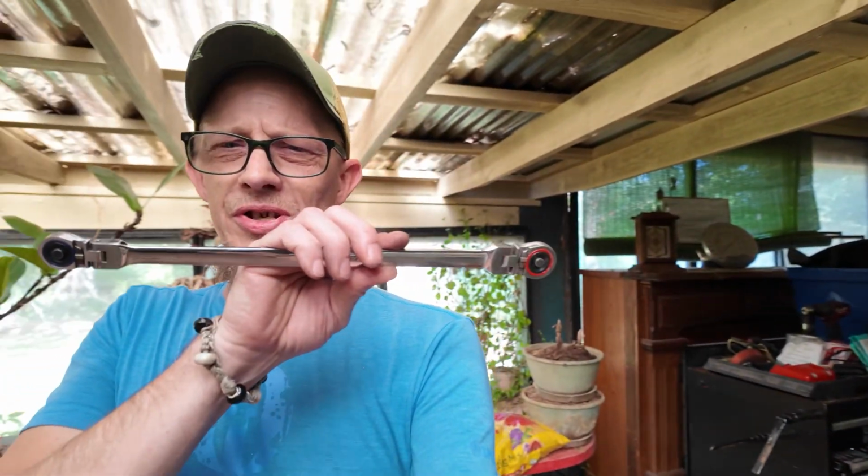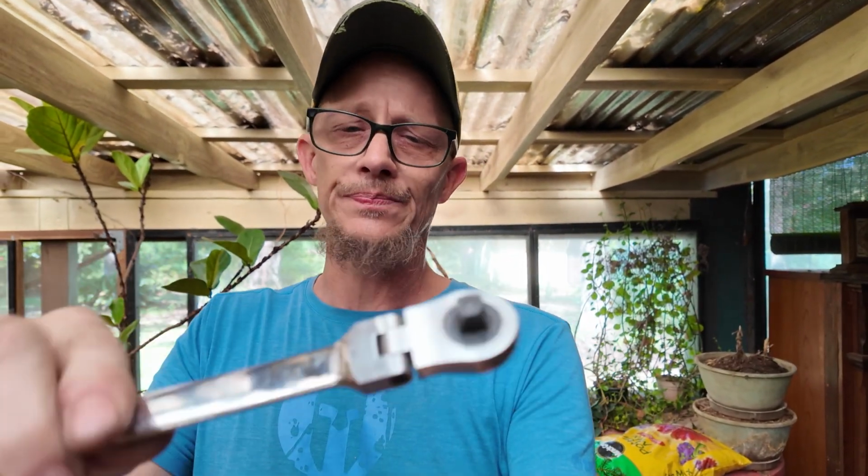dope. While we're ranting about ratchets, this tool, I'm sure you've seen it, it's a 3/8 flex head and a 1/4 inch flex head, right? Kind of the same thing with this tool. You put any real torque to it, and it blows the head off of it. It blows this ring out of it, and then it won't stay together, it won't do its job. This is like the third one of these I've had. I heard Harbor Freight changed that design, but it's still that design in their catalog. It's still that design in the store that's local to me. So your mileage may vary on that one.